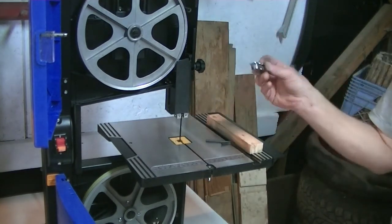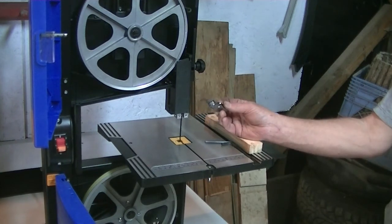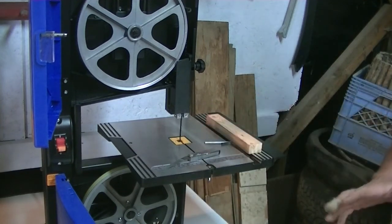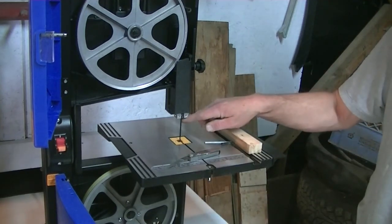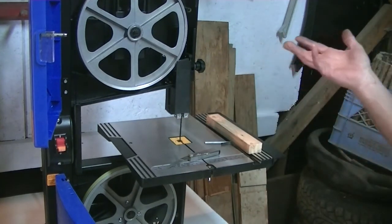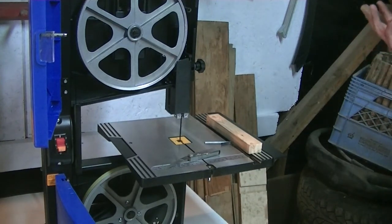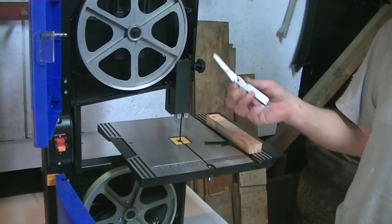And it doesn't cost much for a feeler gauge. If you're wondering what the measurement is in 2,000ths, it's 0.002 inch, or 0.051 of a millimeter. That's really super thin stuff. In the book, they suggested using a playing card, actually. But I think a playing card is way too thick in here, because all card brands are different thicknesses. So get a feeler gauge. They don't cost much, and they're proper.